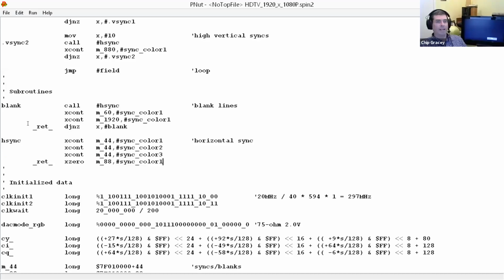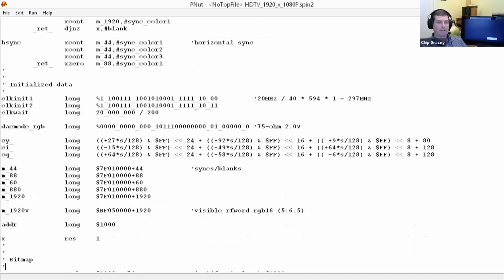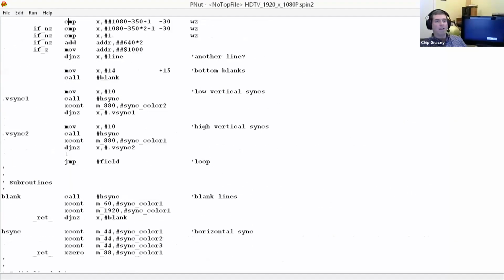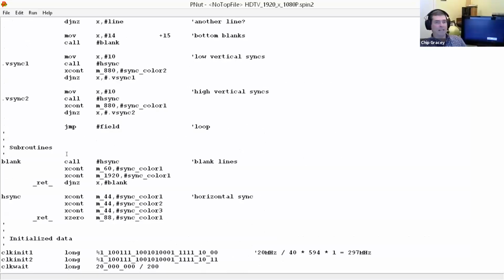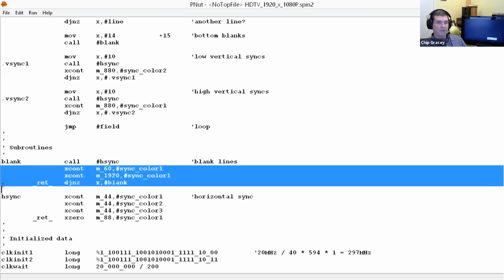You can also set up an interrupt that tells you when it's empty, so you could actually drive all this video from interrupt code. It's very simple to do. That way you can have your mainline code doing something totally different, because the streamer commands are only required periodically to keep things going.